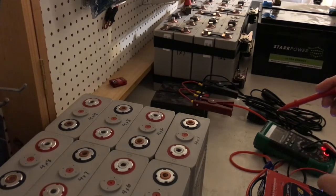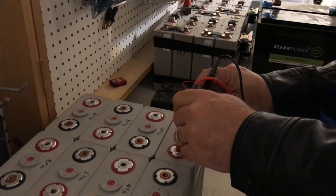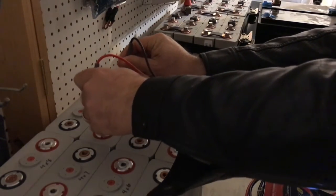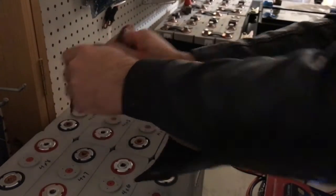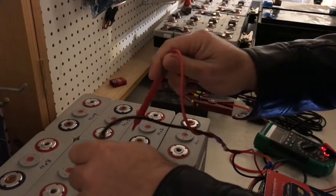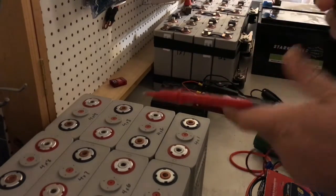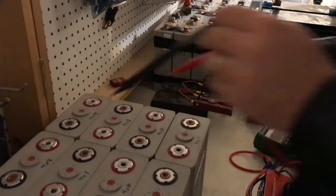It's pretty late — about 10 o'clock — so I probably won't get through all eight tonight. Let's go through these and see where they sit. Battery one: 2.82 volts. Battery two: 2.82 volts. Battery three: 2.82 — it was at 2.81 but recovered a little more. Battery four: 2.82. Battery five: 2.82. Battery six: 2.81. Battery seven: 2.78. And the battery we just finished discharging is at 2.70 volts.